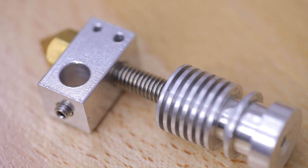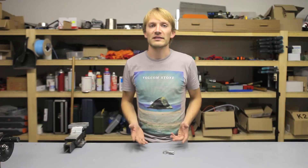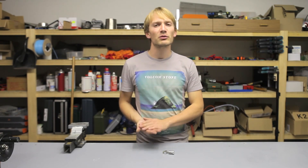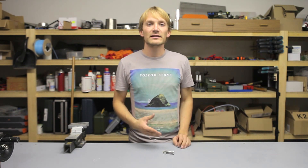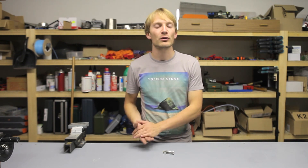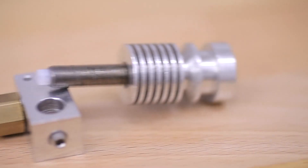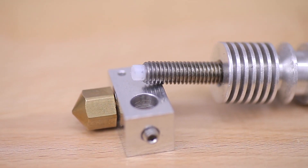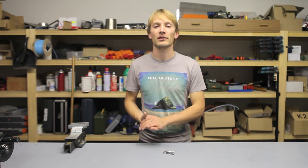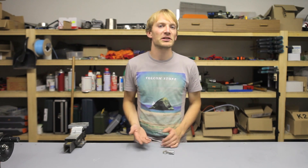My first thought when I saw this hotend was, well, it's another bad tried-and-true all-metal hotend, but that's not what it is. Starting with the fact that it is not an all-metal hotend — and frankly, it would be a pretty bad design for that. Instead, it's more similar to a J-head without the PEEK insulator, which can degrade or deform over time and cause some nasty issues. The Alu Hotend still uses a Teflon or PTFE liner all the way from the heatsink up to about the center of the heater block, and I know that's something some users are still looking for, especially as the early all-metal hotends had some jamming issues with PLA.